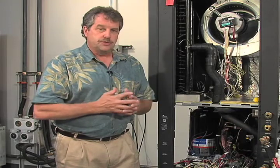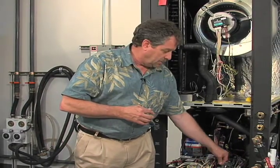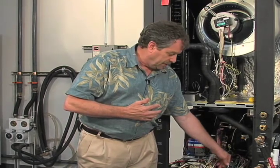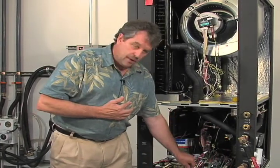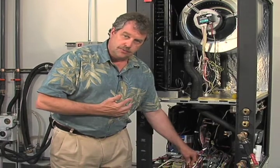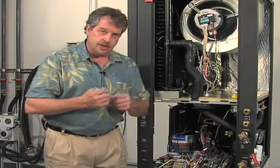Okay? We will do this repeatedly until we no longer are getting any air out of the reheat coil. And again, once we finish up the process here, before we close up the cabinet of our whole house dehumidification system, we're going to make sure that we have placed our terminals back where they need to be. For example, we want to make sure that our red wire is back over here on the normally open accessory 1 terminal, and we want to make sure that we plug back in our thermistor. Okay? Make sure before you close up the box you've reestablished things.